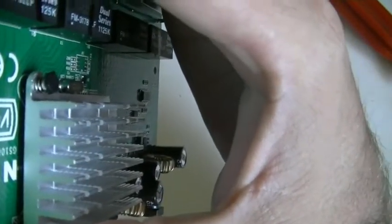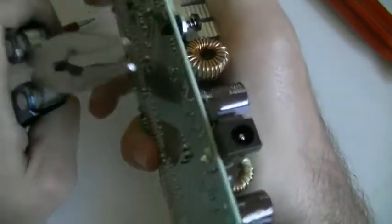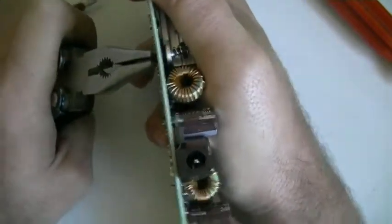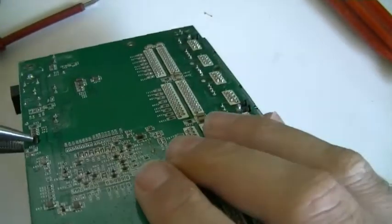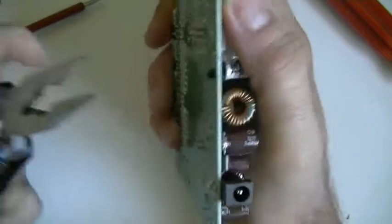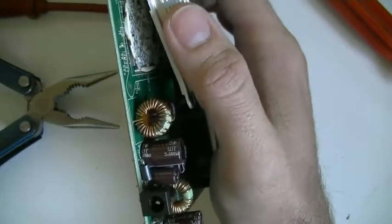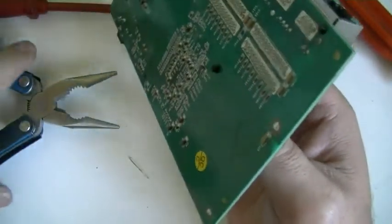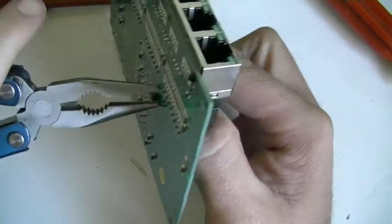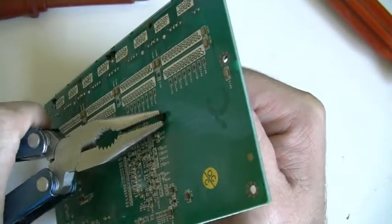You actually get damage to the IC in this, unless it's inductively coupled. From what I can gather, the building didn't actually get a direct hit. I believe the building next door — or the residence next door — is a bit of a ham radio nut, so it's got a relatively big twin-pole long-wire antenna, sort of like a large AM radio antenna in the backyard. And one of the support poles for it is on the same corner of the building where the computer that this was connected to actually failed.